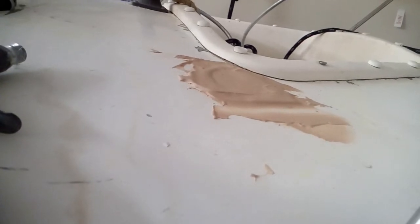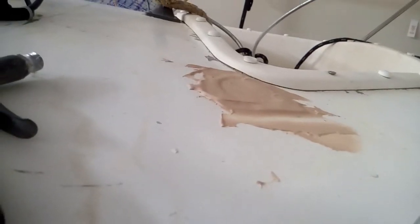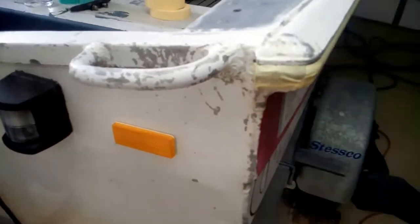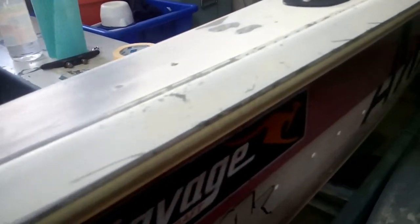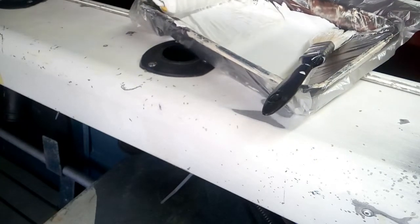The previous owner had rod holders in there. I put aluminium sheeting underneath and used an automotive two-part — what we call car bog, I suppose — a fiberglass-type putty. Very simple, takes a few minutes to dry, then you can sand it and off you go. This primer goes straight over the top of all these different surfaces. I've given it a light sand and we'll see what it comes up like — I know from using it on many other things that it'll come up great.